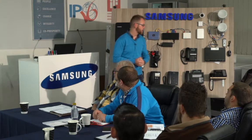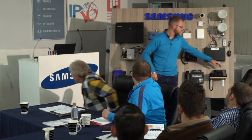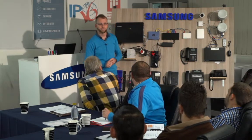The only thing that you're going to have to do on site is if the client wants these DSS buttons programmed. They're extremely easy to program. It's not like the office server where you have to log into the PABX and program them. On the hosted solution, press and hold the button and you choose the option that you want. And then it's configured. Okay.